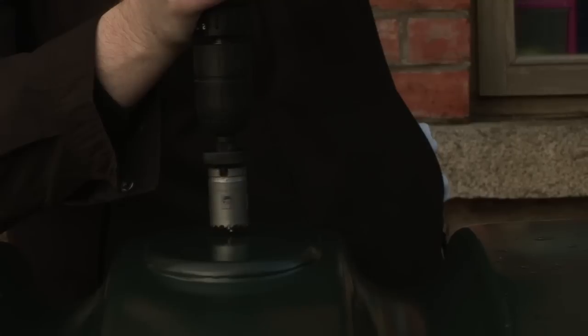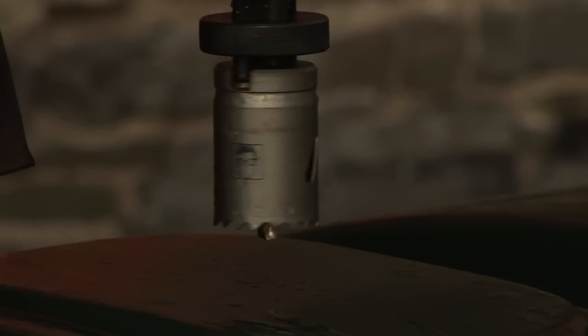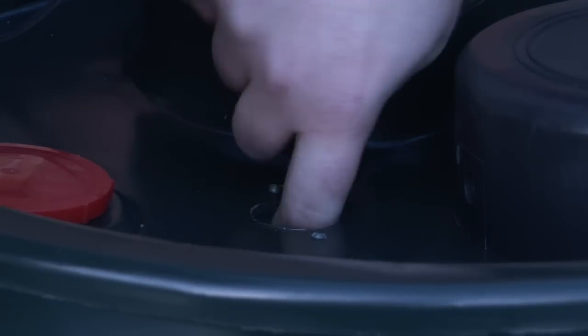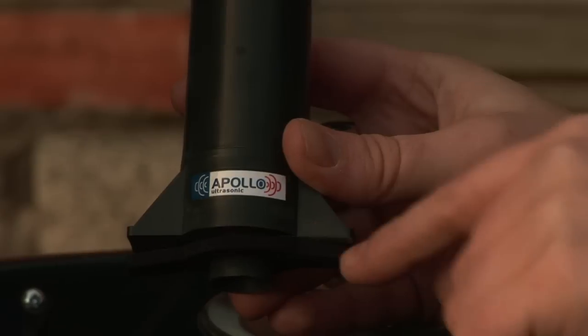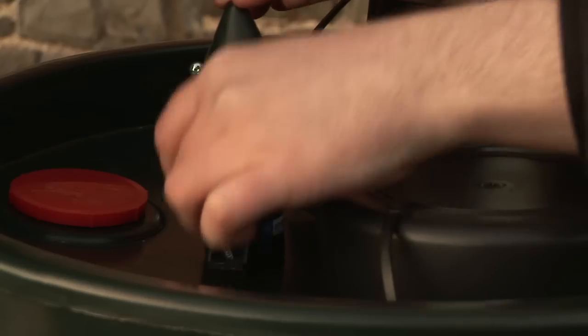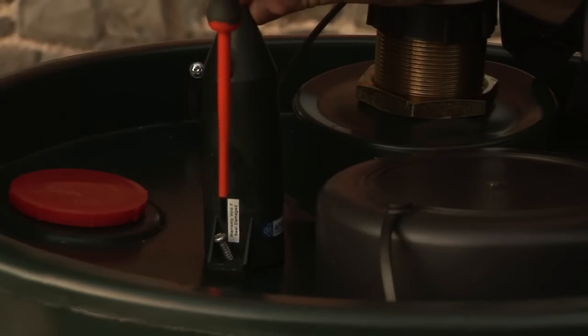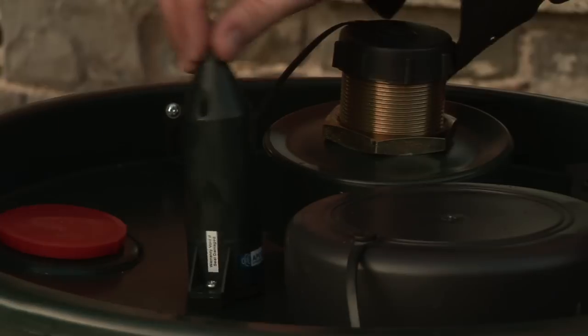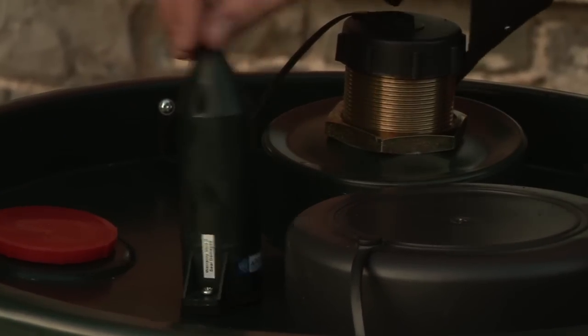Use an electric drill and a drill bit to create the 32mm diameter hole required. Where pre-drilled holes are available, unscrew the cap. Check the hole for any possible internal obstructions. Make sure that your transmitter has its weatherproof seal. Attach the transmitter with the two screws provided, and ensure it does not wobble and that the transmitter is screwed down firmly.